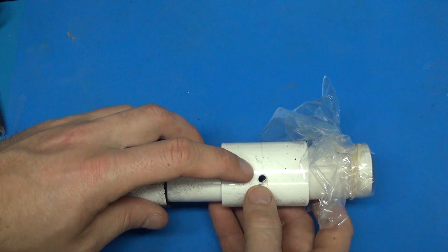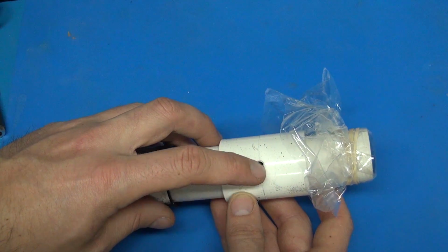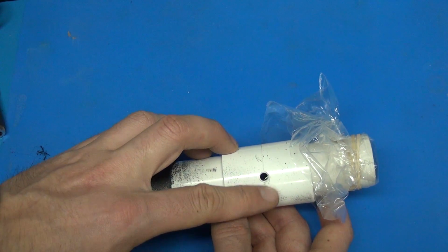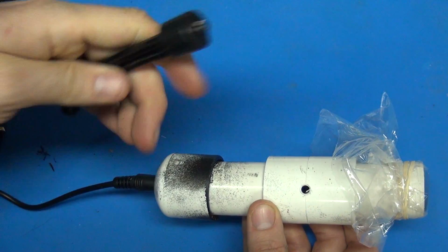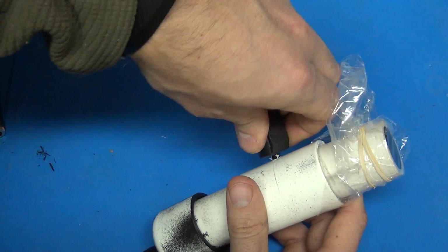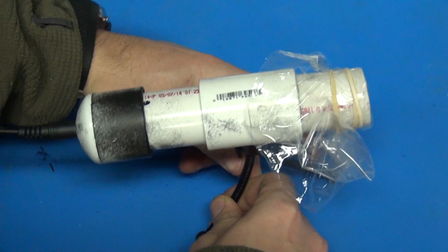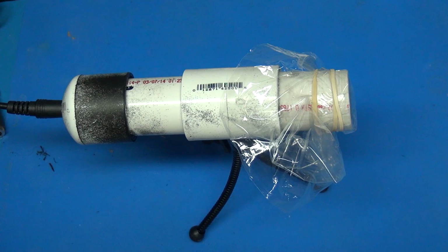And I realized one thing I didn't mention before, but I drilled a smaller than 1/4 inch hole, and then I put a 1/4 inch by 20 thread die bit through here. So I basically threaded the plastic. The reason to do that is so you can attach, I mean, these are just little tabletop tripods, but you could attach any kind of tripod you want. And the idea is now you can use your tripod to hold up the laser and the light sensor.